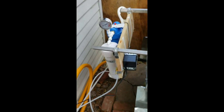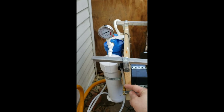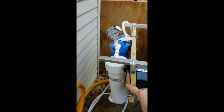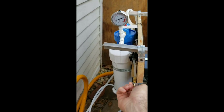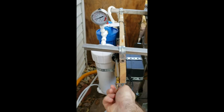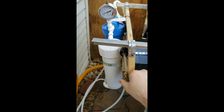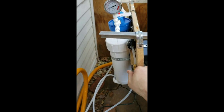We've got the sap fully coming out now. We're ready to adjust the needle valve. This needle valve is going to increase the pressure of the system, starting to reject the water that permeates out of the sap and increasing the sugar concentration. We've got to tighten this almost all the way down — we're typically about a half a turn off of having the valve totally seated to get to a good pressure point.